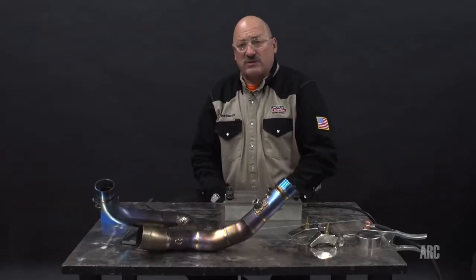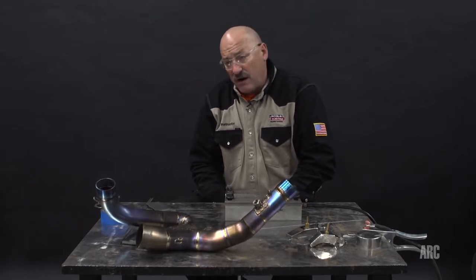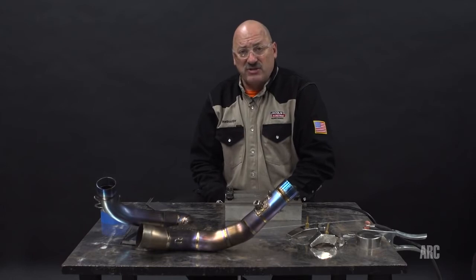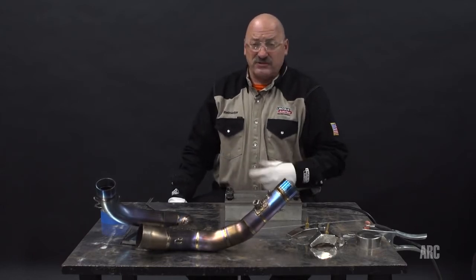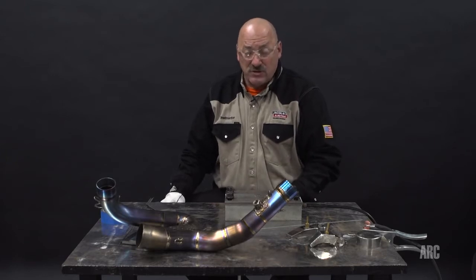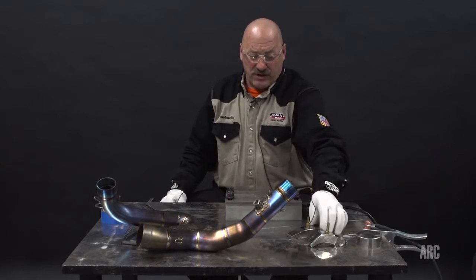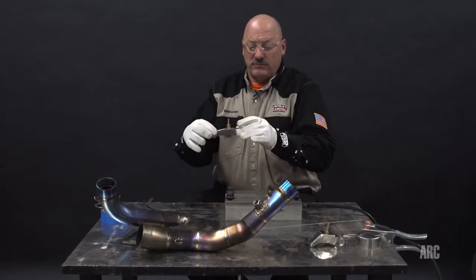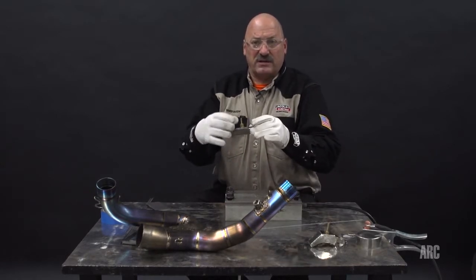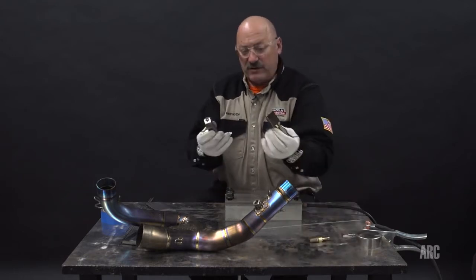One of the important things with titanium is it is hardened from oxygen, nitrogen, carbon, and other elements. But oxygen is one of the primary hardening agents, and that's in the air we breathe. So it's very important that the titanium is thoroughly shielded during welding and also after welding. We use sometimes trailing cups to trail behind us as we're welding to keep the titanium covered until it cools down. They have different types of trailing cups here.